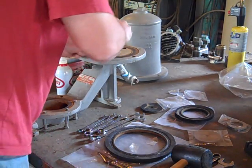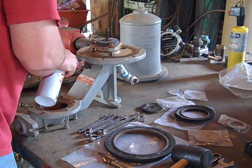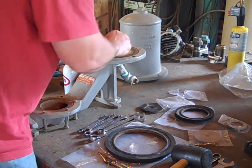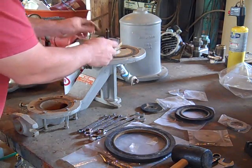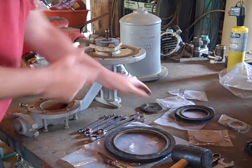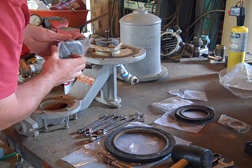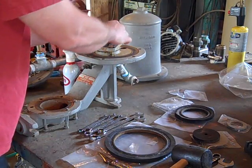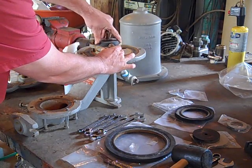Everything's in good shape. Like I said, this thing's in water 24/7. I've used this ram for about twelve years, maybe a little longer. This valve here is the check valve — the water actually shoots up in there and blows out; the pressure in the chamber keeps it sealed. I put a new one in there. It's a lot thicker than the thin one that was in it. I'm going to try this thicker check valve this year and give it a shot.